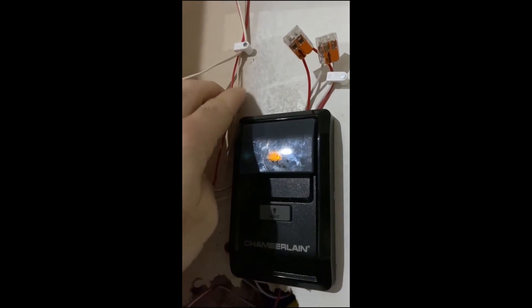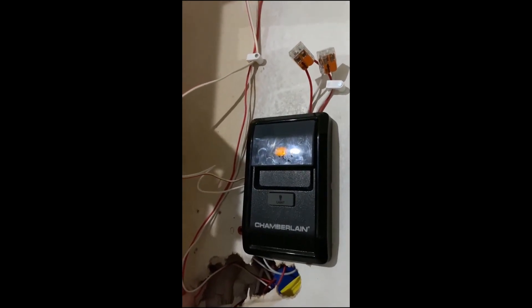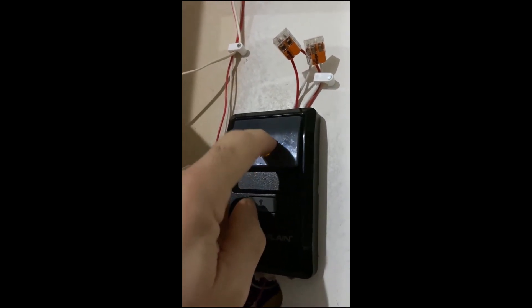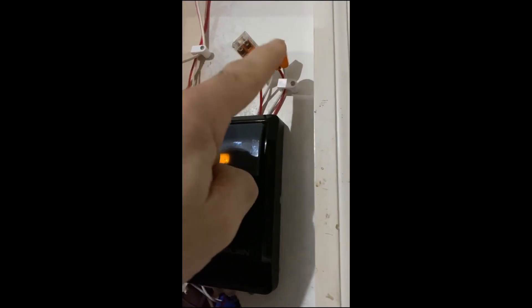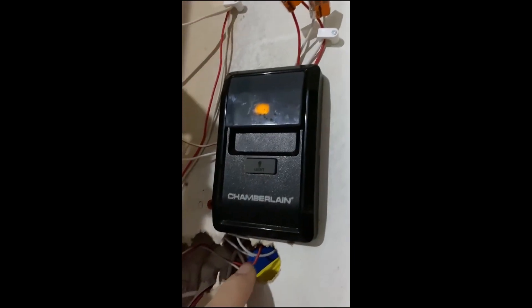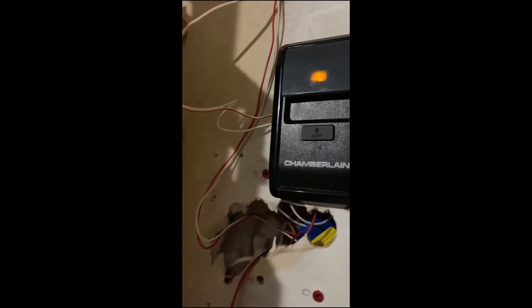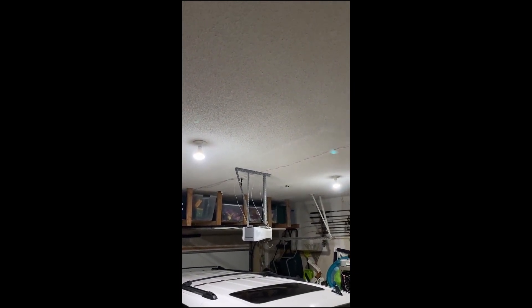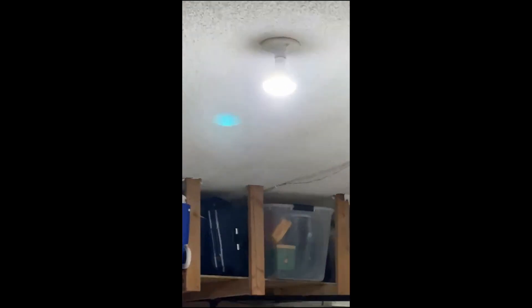These two are the ones going to the reed switch. So these come in, go to the circuit board. My soldering job from the circuit board comes up, goes into these. They come back out, in behind this, through the wall, down into the Shelly. And then that all goes up and over. The two of them go to the opener and two continue on to the reed switch.